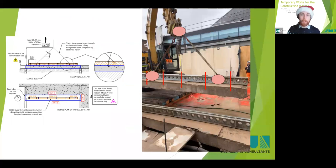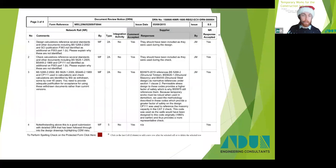So as part of the demolition, we had to devise a method to carefully remove the slab, where some live services were located just below the slab soffit. This is another example of risk reduction through design. There was a crash deck beneath the slab, over the services. However, we worked with the demolition contractor to plan a cut and lift method in these areas, with traditional mechanical demolition with a breaker on the end of the excavator arm used where these services weren't. So this worked very well and ensured that the services were not damaged during the works.